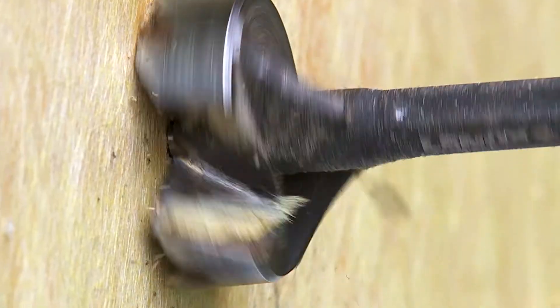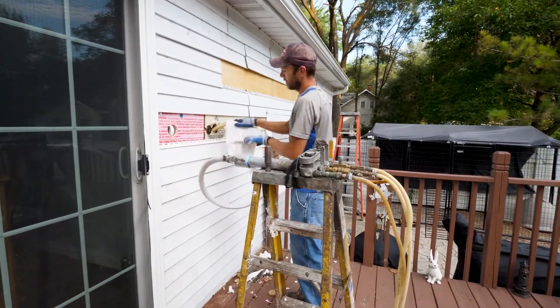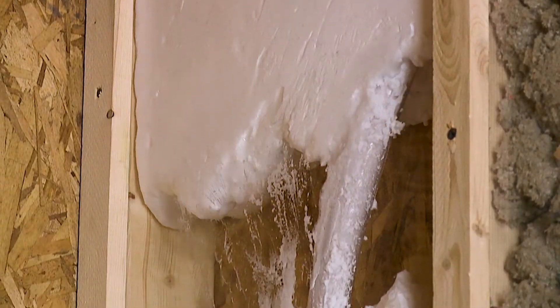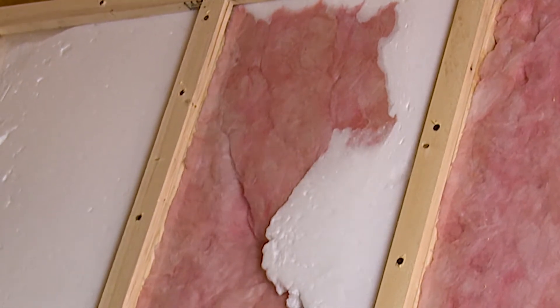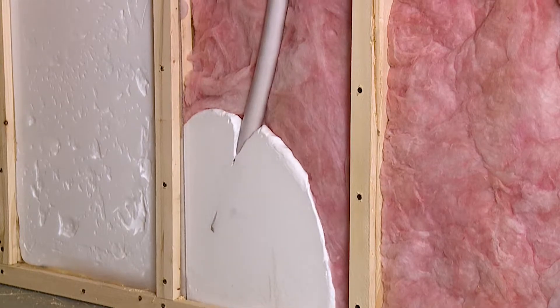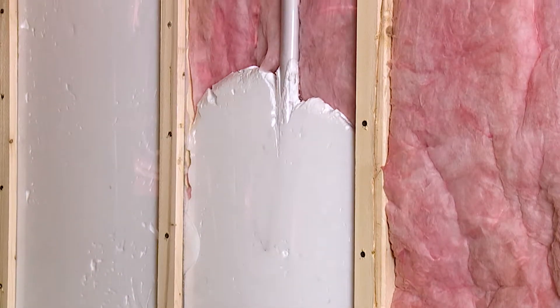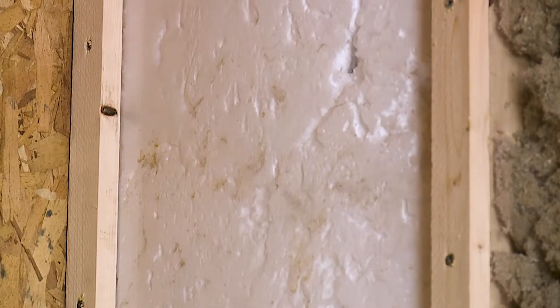If you're looking at your wall, we usually want to drill a hole right in the middle, then run the hose up and down the cavity. As we're pulling that hose out, we're injecting the foam, filling up that cavity. Before this, we want to make sure there's access all the way to the top and the bottom. We double check that when the hose is installed inside the cavity, and then we top off the middle section as we finish pulling the hose out.